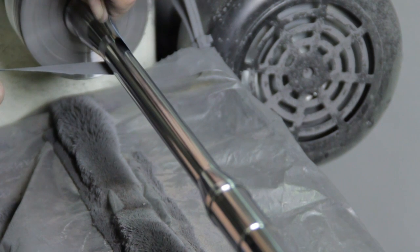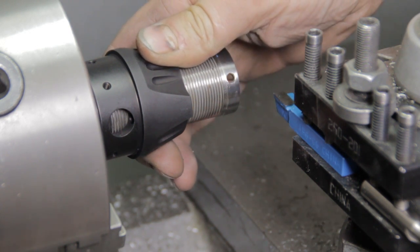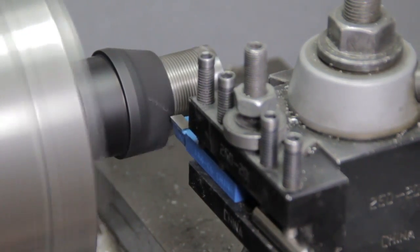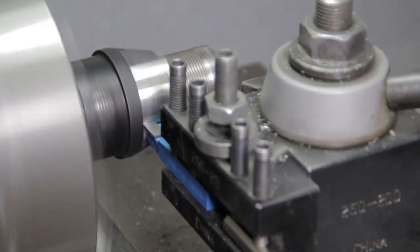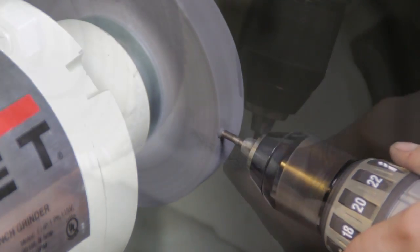As with the comp, we'll repeat the process with higher and higher grit sandpaper for an increasingly finer finish. Finally, we turn to our hand guard nut, which we'll chuck up in a special fixture for our metal lathe in order to remove its anodizing. With our tool calibrated, we make an initial pass, increase the depth slightly, and go again. For the final accent on the rifle, our last step is to put a high polish on the hand guard screws, touching them off with the Scotch-Brite wheel and then the buffing wheel.